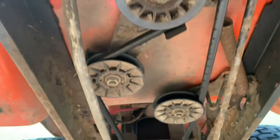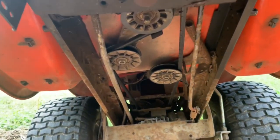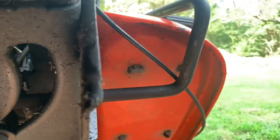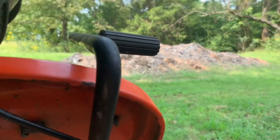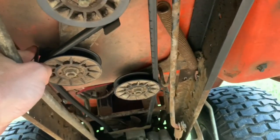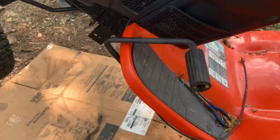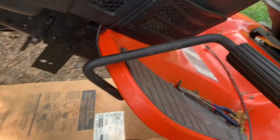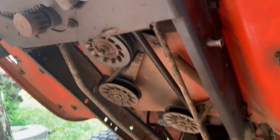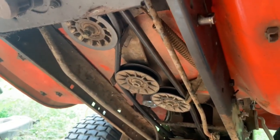You can see the belt goes down there back to the rear transmission. The first thing you want to do is push the left clutch in over here, then put the brake on — that will push this in and loosen up that belt. You just push this forward and you can see how it loosens up the belt. I'm going to lock that in place.